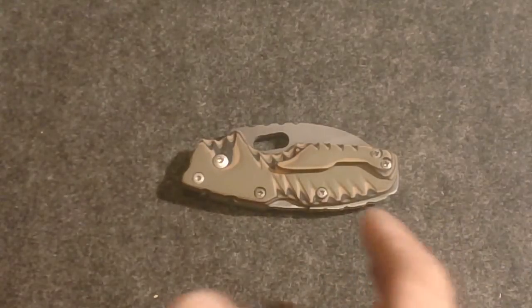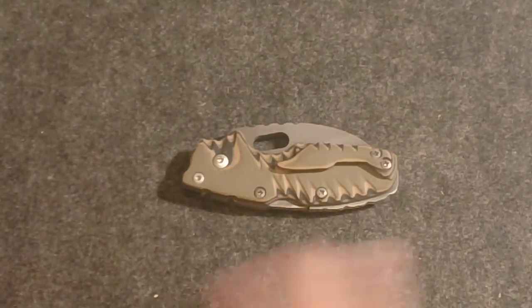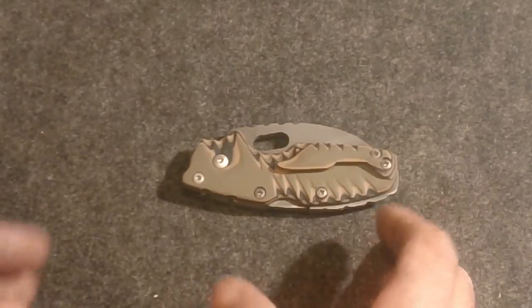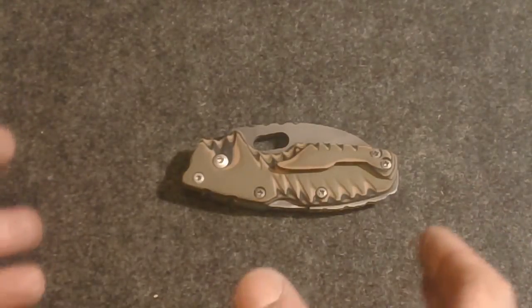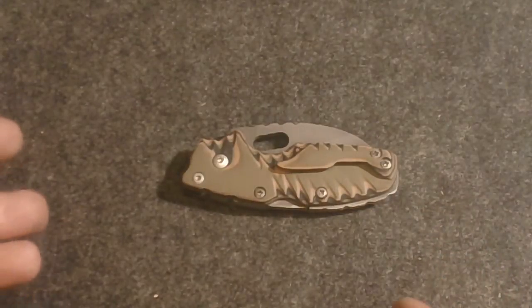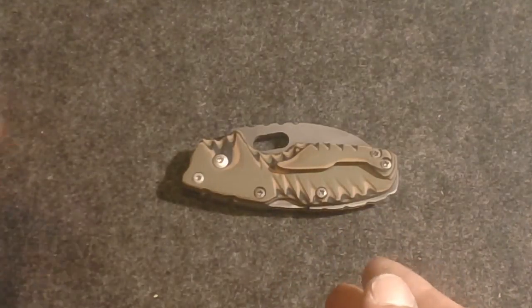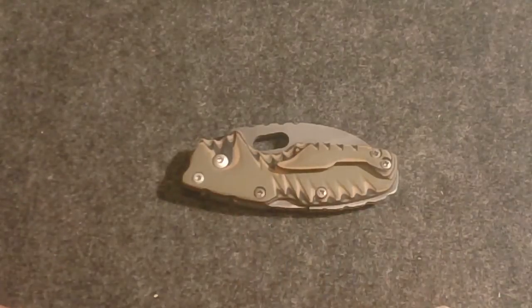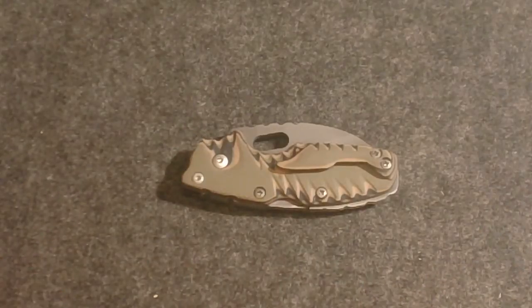It took a minute to do. Usually I can do a complete mod on a knife in about a day or so, maybe two days at the most — grinding blades and changing everything up. Scales don't take too long, but this was a little challenging. The Cold Steel Tough Light has GRN construction — GRN handles with no liners, very simple, very minimal in parts. You've got your two scales, the blade, the lock back, and pocket clip — like five or six parts. No liners or anything. So there's not much to go by, and you have to be pretty much on point with drilling your holes because it all affects the way it finally locks.